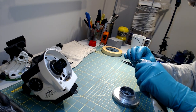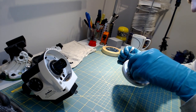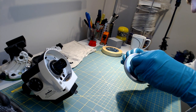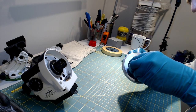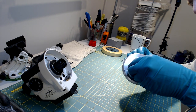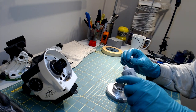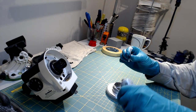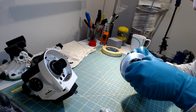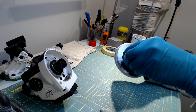And something to note, you can never have too much grease. Well, actually, I suppose you could if you're getting it all over your clutch pad, but when it comes to against the gears and that, don't be afraid. Grease is your friend in this situation. Not only does it stop metal from wearing, but it keeps everything tight. It fills in that gap of play that you end up getting, especially in our backlash.